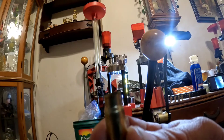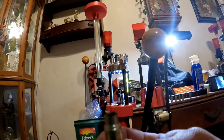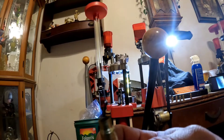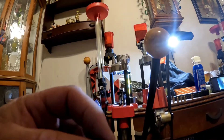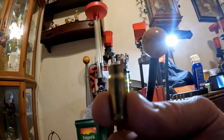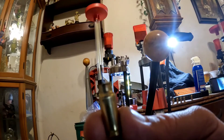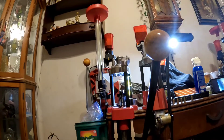What it does is it helps on that 23-degree angle so it's not so much just a straight-wall casing going into that die. It also brings down that neck a little bit, so it's going to help all the way around to keep it from gouging the casing and collapsing it.